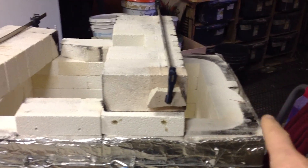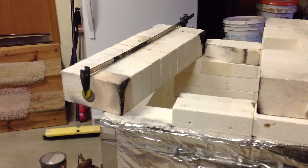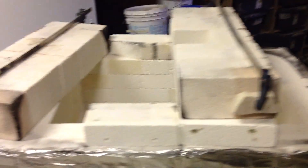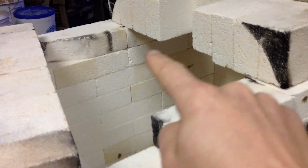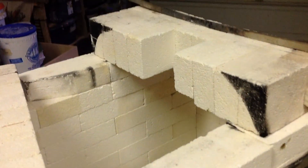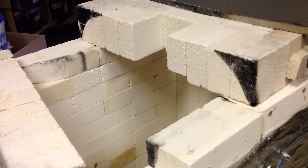Another design feature is these two bricks here. Rather than just make a flat lid, it stair-steps up — lid piece up, lid piece, lid piece down, lid piece. I put a few bricks where the step is to help give it more insulation. That creates a little gap here, a little extra air space, one brick high, so that if I stack a shelf that goes to there, I don't stall my kiln. There's still a little bit of space that allows the flame room to travel, which is a pretty important step because I tend to stack the kiln all the way to the top.